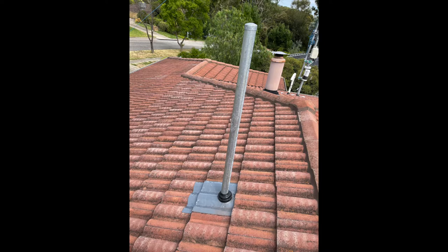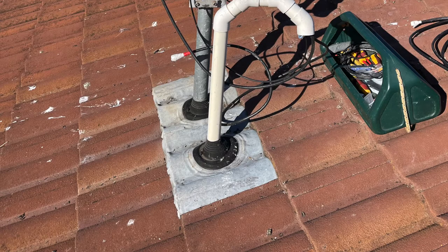The most common method when you've got a tiled roof — and in this particular instance that you see here, it's a concrete tiled roof — is to use a product called a dektite. A dektite, as shown in this photo, shows how a little mast is coming out of the roof, and of course the mast is mounted underneath. The problem with a dektite is it will need some structure underneath, and the mast and whatever you're sticking out needs to be mounted to that. So for just a cable outlet, you can see an example here of a cable outlet that prevents water from getting in, but it's a less than ideal solution.